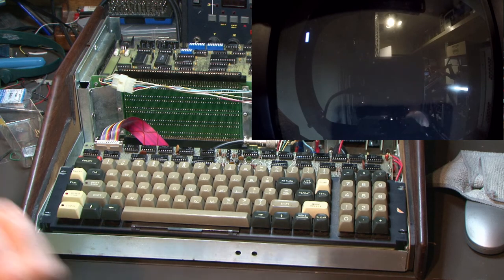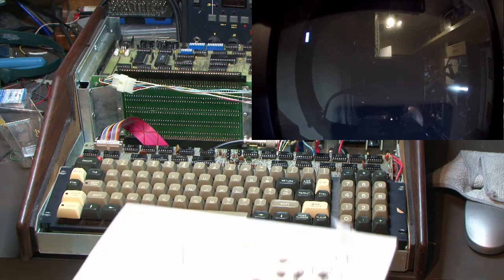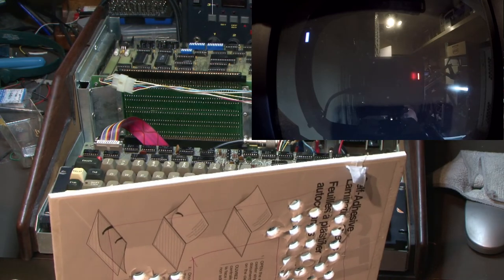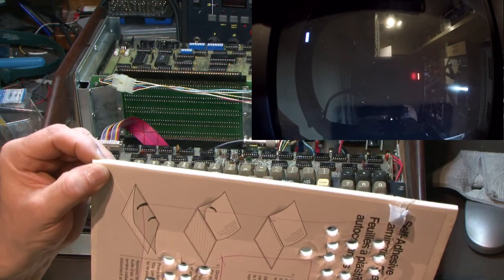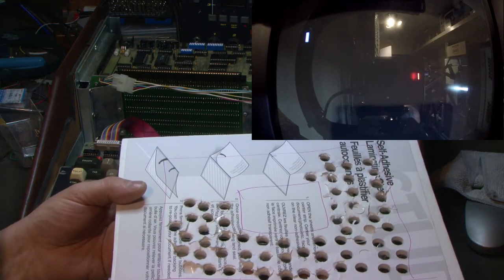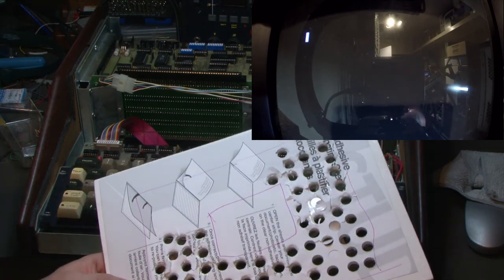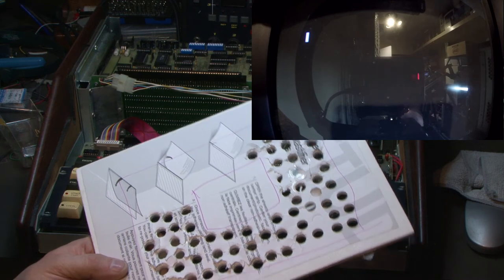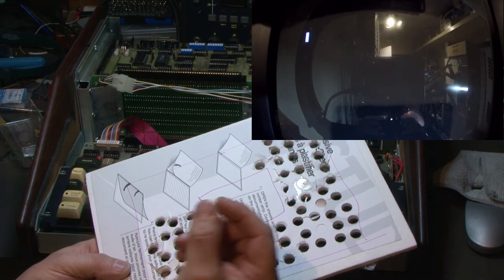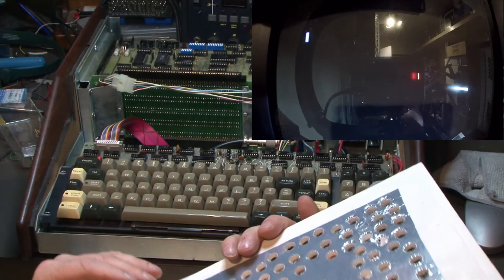Like I said, we're going to change out the keypads if I can find a better foam. This is a closed cell foam. I think it's even like a neoprene or something like that. It's definitely not good to use because it kind of squishes and deforms. So if we can find some open cell foam that's fairly dense, I think that's the ticket, because that's what the original foam was from what I understand. And it needs to be fairly dense so that it has a little bit of pressure to push on the pad, but not so dense that it deforms when I hammer them out. So overall, it's fairly successful.